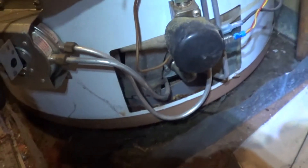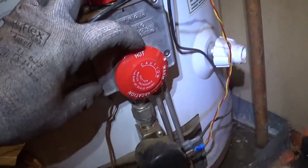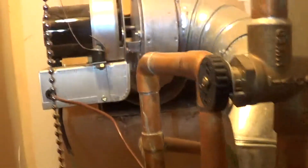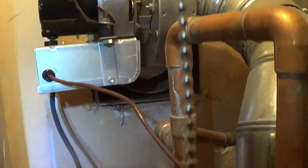This is a water heater — it's leaking, but I want to show how it works. The flame turned on. Now you can hear the makeup air is on. You can actually see it's blowing air down there, but that's all cold air. It's not that good of an idea to do that in these closets because now you're going to have cold air blowing in the closet. And now we have the exhaust right here which is running and it's exhausting out exhaust air.